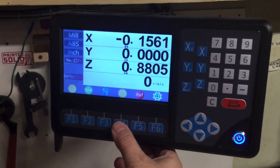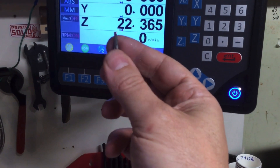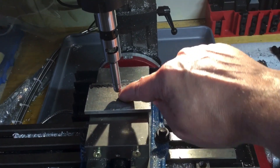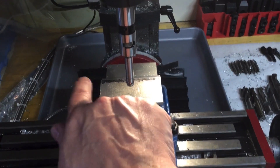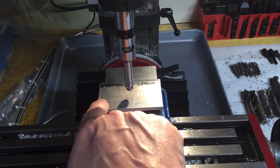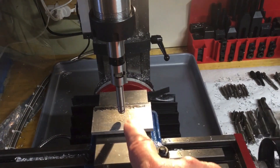I want to change this to millimeters because the cutter I'm going to use - I think that's a 4mm cutter. I'll put the 4mm cutter in and I'll mill the first channel, then go over 8mm to another one, over 8mm to another one, over 8mm to another one, then I'll come back to the middle and do the same thing over here. If I just would have started at this edge and done each channel all the way over, the last groove may not have been perfectly even with the first groove. By starting with the middle one and doing the same either side of that, I'm guaranteed that it'll be symmetrical. Let me get that swapped over and get the cutter in.